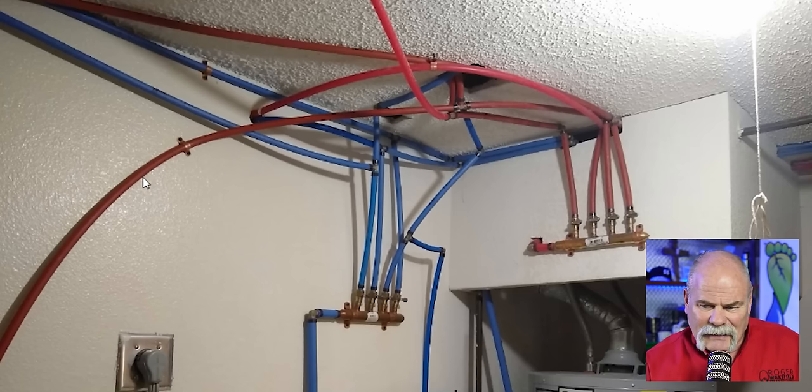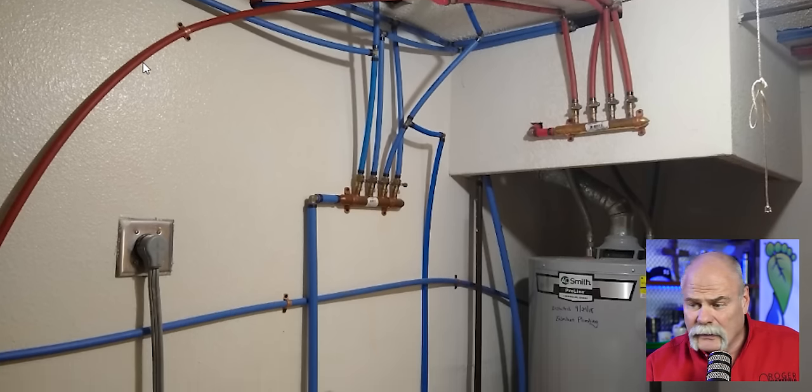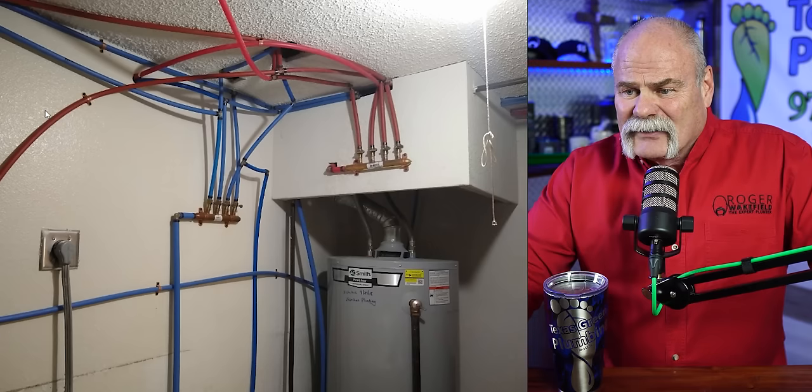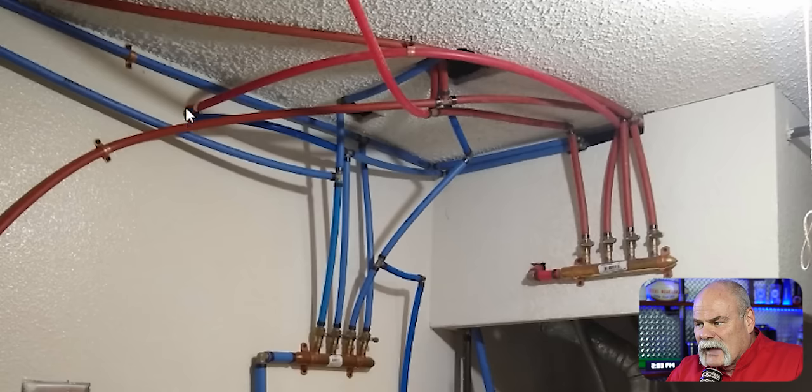It's kind of hard to see what goes where and how it ties together. Right over here on the top left side, it looks like the hot and cold may be tied together — this could lead to a problem. If not, it's just a pretty messy plumbing job. From another view, this is actually a pretty good plumber because at least he did not run PEX all the way down to the top of the water heater — you do have to maintain 18 inches there. But this is pretty wild. It almost looks like the hot and cold are tied together up top.